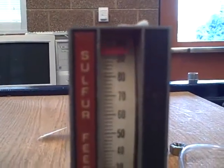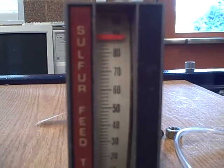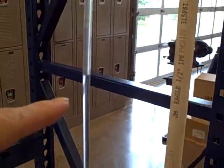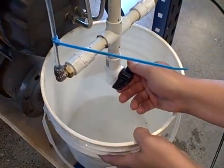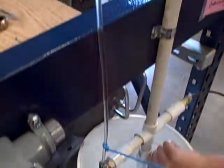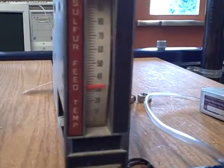Go ahead and slowly drain the water. I am going to go back over here to the field indicator and as we slowly drain water out of the water column we are going to see this indication come down. Water is draining out, the indication is coming down, we can see the water level drop here in our sight glass, see the water draining into the bucket. The water level is going to come down all the way to the lower range value then the valve will shut off. We come over here to the indicator and we see the indication coming down.